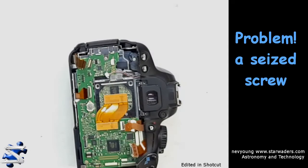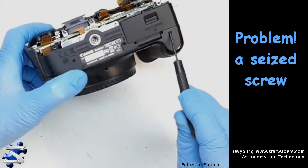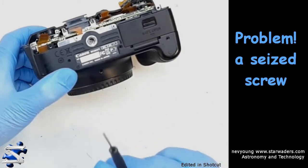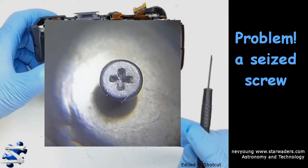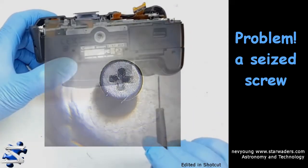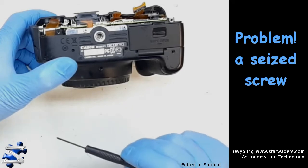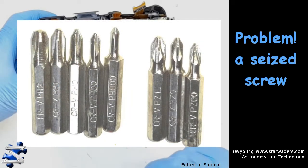We're back at this camera, and it's taken me a long, long time because yesterday afternoon I couldn't get that screw out — it was seized. The screwdriver I was using was really becoming badly distorted; its tip was really being ground away. I went to the local hardware store this morning and what I got turned out not to be the right thing. There seemed to be quite a number of variations in the standards of what is called a Pozi Drive screwdriver, a Phillips screwdriver, a Phillips 00 size, and a Phillips 0000 size.